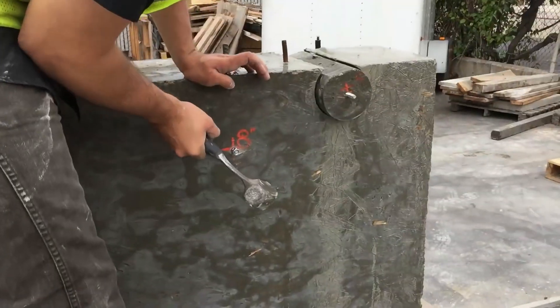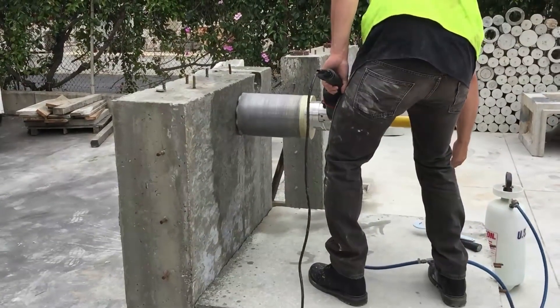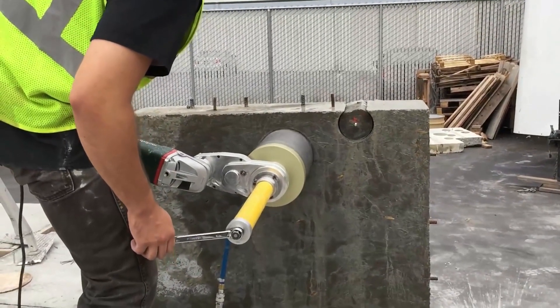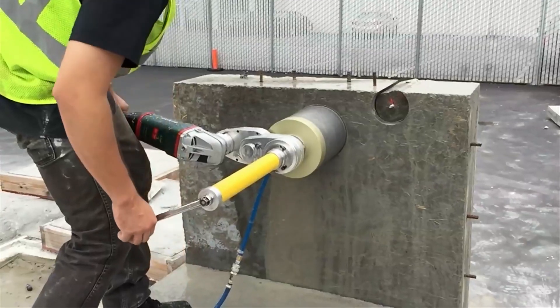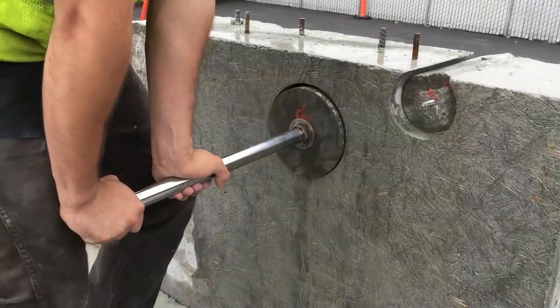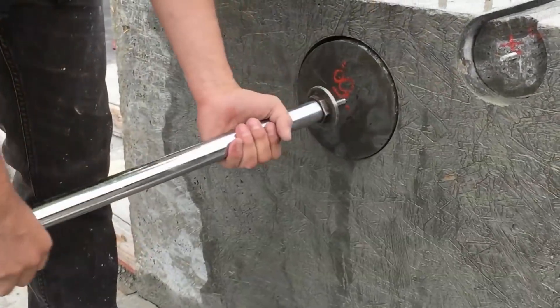The best cutting speed is achieved by increasing the feed until the drill bit starts to slow, then ease up a little. To remove the core from inside the core bit, simply reverse the feed handle. With the core still in the hole, dismantle the CoreEasy machine from the guidepost. Pull the guidepost sideways to loosen the anchor, and the guidepost will now loosen by hand.